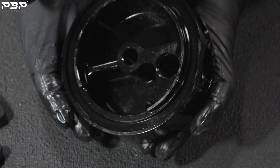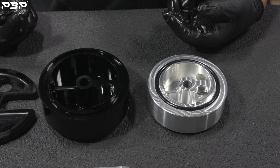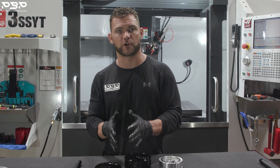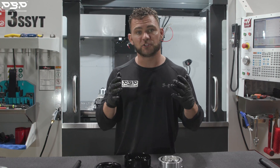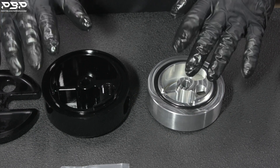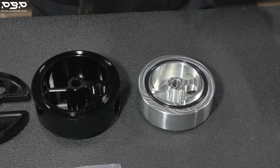Now let's flip it over and take a look at the guts. Let's slide in our baby Pac-Man fuel sump for comparison. Right off the bat, you can see the big Pac-Man fuel sump is much bigger versus the baby Pac-Man. They both have a job to do: fuel comes into this port, fills up the sediment port. If you have any sand or anything rolling around in the fuel tank, it's going to fall to the bottom. You've got an 1/8-inch MPT — pull it, and all the fuel comes out. You're drained and ready to go.